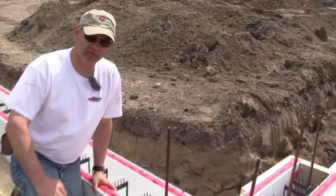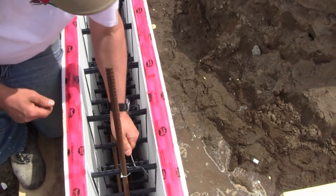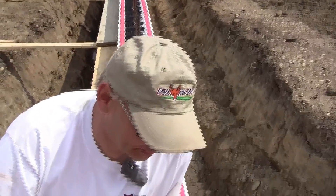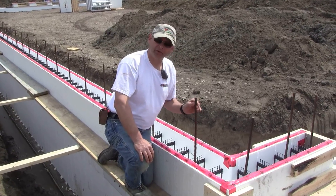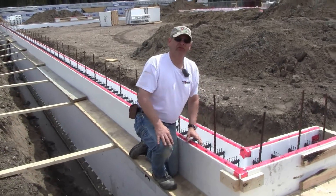We ended up doing four rows instead of three because they ran into clay and had to dig deeper. We used the FoxBlock HV clip, which you can remove and clip back on for vertical use as well. This was 560 lineal feet of wall and it took us one day to build — about 14 hours total with a crew varying from six to eight men. Our man-rate was about 0.035. We used 10mm bar for horizontals, equivalent to a number 4 bar, and 15mm for verticals, equivalent to a number 5 bar. The job will now go another 18 feet high.